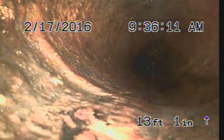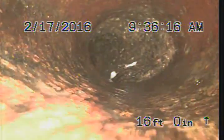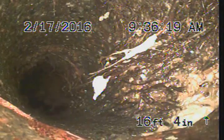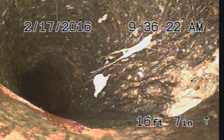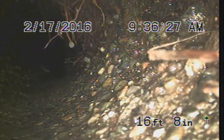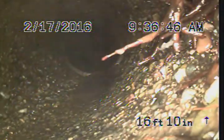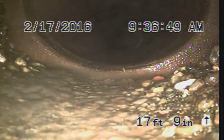That's still in the house, yeah, it's still in the house. Roots coming in, really aggregate concrete pipe. How far in is that? Right now we're 16 feet 8 inches in. Then we have 5 feet out of the hole and then our drop loss. What I can do is I can zero it out. That would be good to know. So that's obviously not in good shape right there.